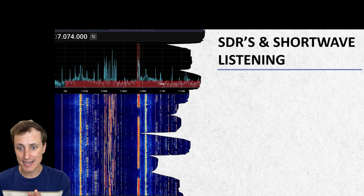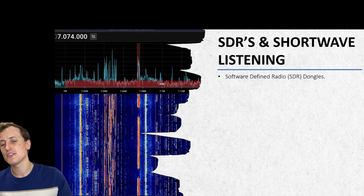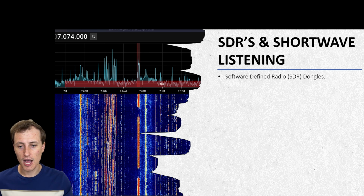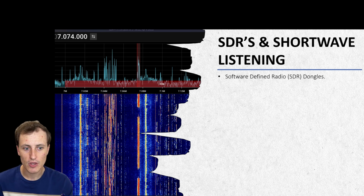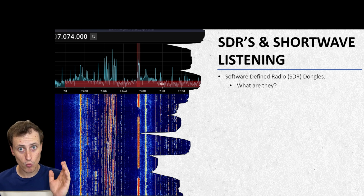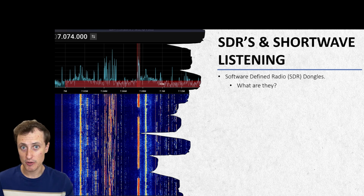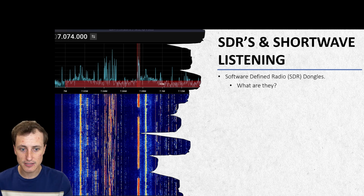So, listening now, we can do that a couple different ways. SDRs and shortwave listening. So what are SDRs? Well, SDRs are software-defined radios, and they come in many different form factors. The packages we're going to be talking about today, we're going to focus on SDR dongles mainly. SDR dongles, what are they? Well, they're devices that accept an antenna on one end, and then they plug into your computer's USB port with the other end, and through downloadable software, you can see and hear wide swaths of the radio spectrum, given that it's plugged into a decent antenna.